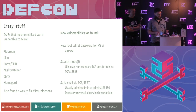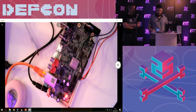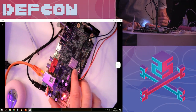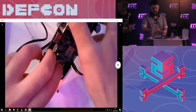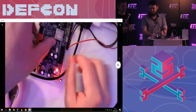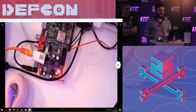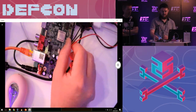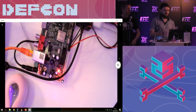There's a common factor in nearly all of these Mirai-vulnerable DVRs, and that's they run a chip made by a company called HiSilicon — that's the main processor sat here. The board, if you flip it over, has got an SPI flash chip on the other side — that's where it stores the firmware. It's also got a serial console, which you can see with these three wires connected. It's a very typical piece of embedded hardware. To get the firmware off it, there were a number of different ways depending on how well protected the devices were. Some were as simple as connecting to the serial port, but unfortunately this one isn't. So we had to use a technique to break out of U-boot and dump the memory that way.